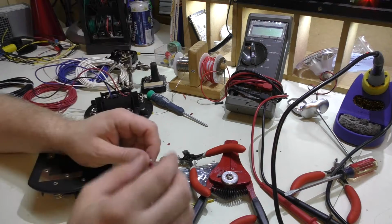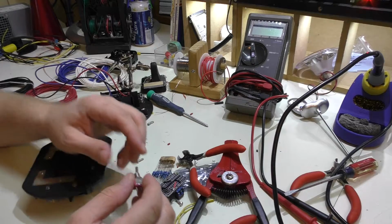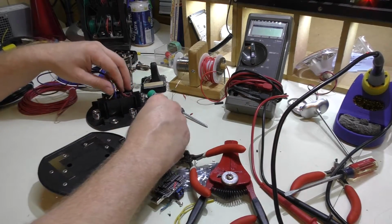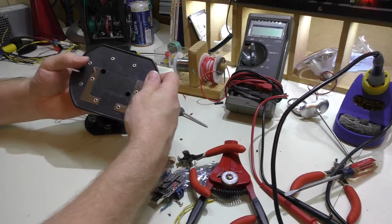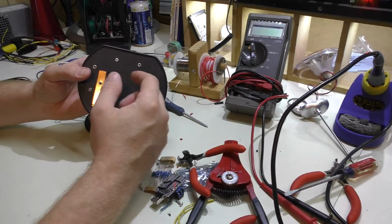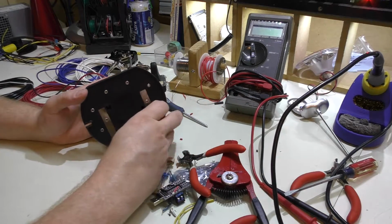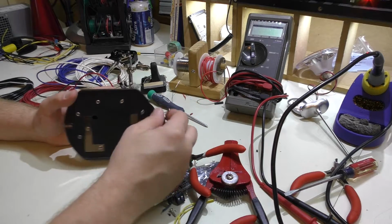set for 5 volts, obviously, and then I can leave the other one either blank, or have it for if I want to put another one in there, which there might not really be room for 2 of them because the switch is going to take up too much space, or I could turn them sideways possibly, or I can put an actual DC jack on here and make it into an output of whatever the batteries are, and then that way you can plug in a little jumper cable and use it to power something else, another device, and then you can select between either the external power output or the internal 5 volt.